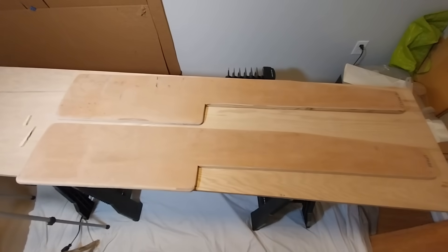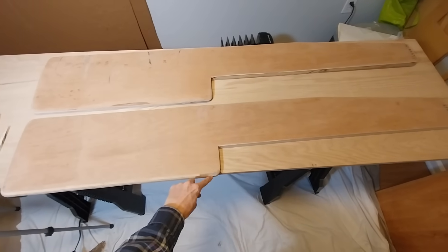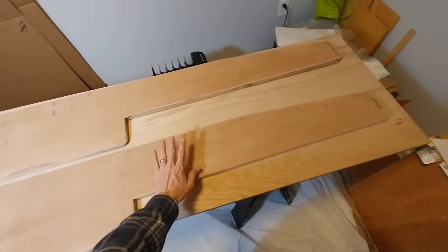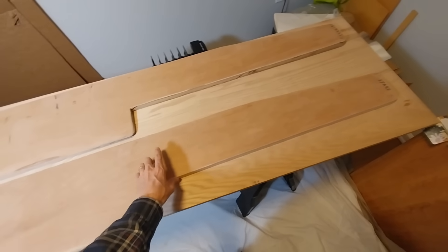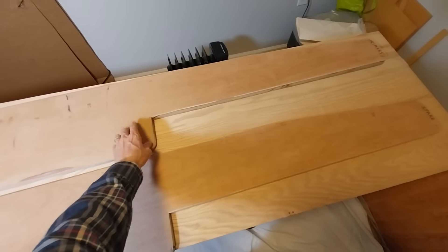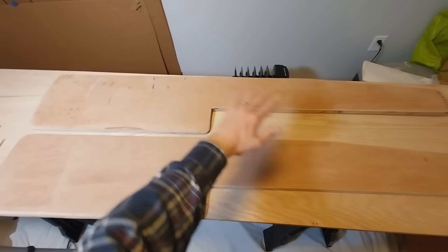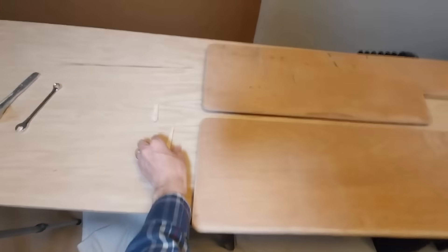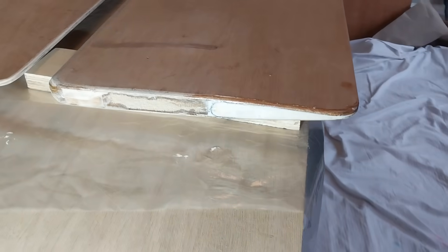I've cut out the primary rudder shape and now it's time to cut out the spare. There are my two rudders — I think they turned out beautifully. After using the router to round the leading edge and rounding the corners with the jigsaw and sanding, the spare came out best. The spare — made using Perry's method — is going to become the primary rudder, and the old primary will become the emergency spare because it glued up a bit wobbly and isn't as symmetrical. Now I'm going to cap the ends using some plywood and thickened epoxy.